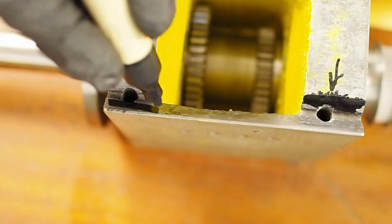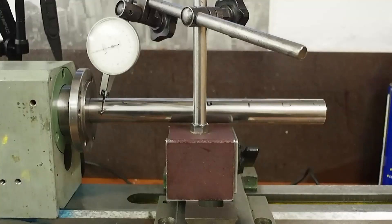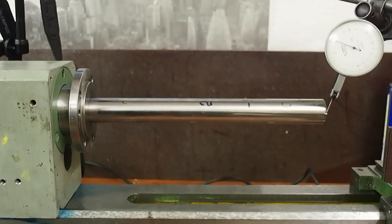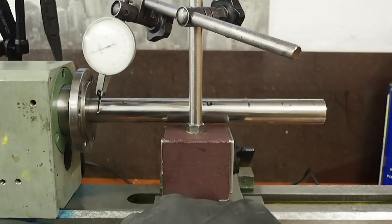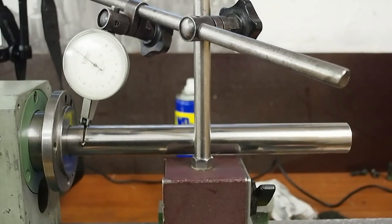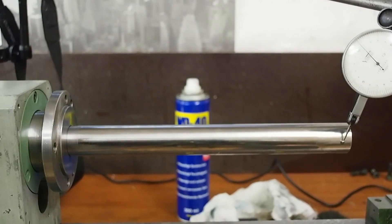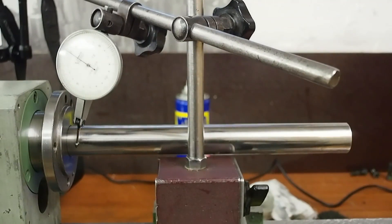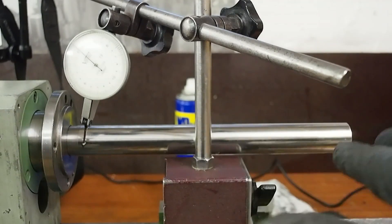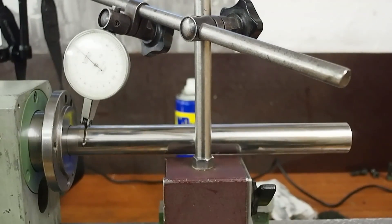So these are the areas I'm cutting — this side, then this side. After one pass, the error has dropped by about a third, so hopefully with two more passes I should be getting close to correct alignment. After three passes, I'm getting quite close — I'm down to about 7 ten-thousandths, aiming for two. But I think I also need to start looking at the vertical alignment in this plane, because obviously one's going to affect the other.